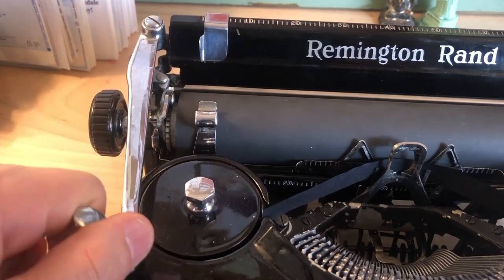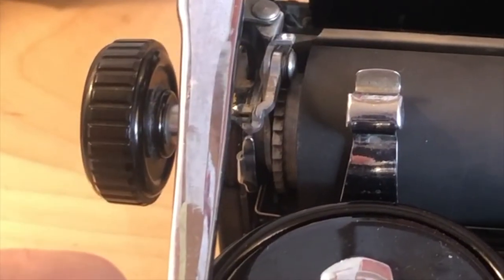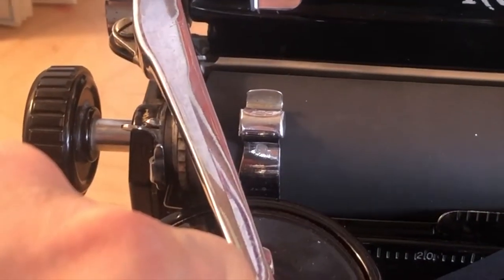When you hit three, you can watch this claw dig into the sprocket here — and you can listen. There. It goes up three times. This claw spacing mechanism is actually very, very simple, and it's actually quite easy to put back together because it fell apart when I was changing the platen. Sometimes when your line spacing mechanism falls apart you're worried, but this time, not so terrible.